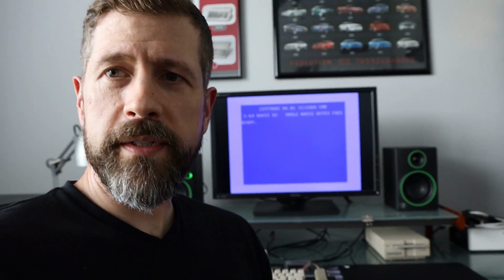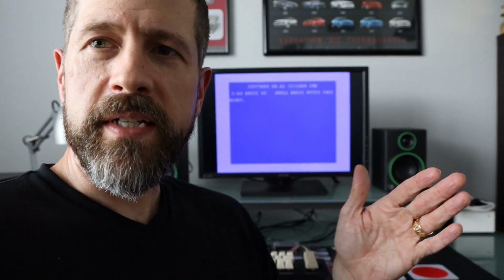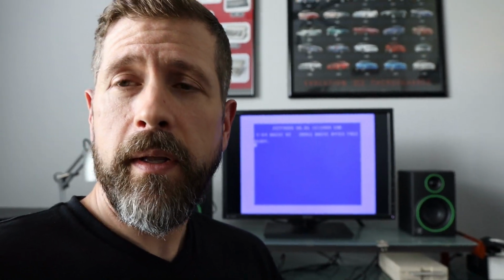So the reason that works to give that encompassing expanded sound is because I have a 6581 and an 8580 playing from 2 different channels, left and right, and the sound is just a little bit different. For one thing, the 6581, the real SID, has an analog component to it, so no 2 are exactly the same. But anyway, mixed with the 8580, which has a slightly different sound, gives a slight dissonance from the left and the right channel, which gives a kind of stereo sound.